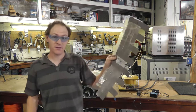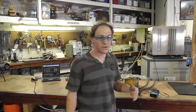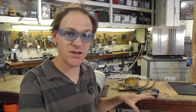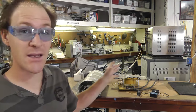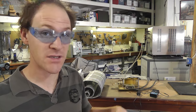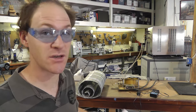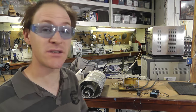Then I'll be taking some of this shielding material and placing it over this with a hole inside of it, just big enough to allow that to come through. Now what I'm going to do first is set a sheet of this over this, and put a magnet on top of this coil and see if it magnetizes. Then I'll remove it and see if it magnetizes, and we'll get a judgment for how much it actually shields. If it shields it completely, then we're in business. If it only shields it a little, then we may need to double layer it.